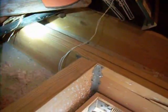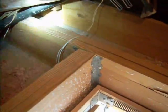I'm standing at the top of the stairs, and what we find as we come up the top here is that there's no service boards right at the top. Now it's required that as you come up these steps, you're supposed to have a service board you can step off onto. Very simple, 3/4 inch ply or particle board, and you can fix it in here and along here. Just cover it up. Probably the best thing is to buy yourself some ply, and you cover up this area here with the boarding, and you cover this area with the boarding, and it will be perfect.